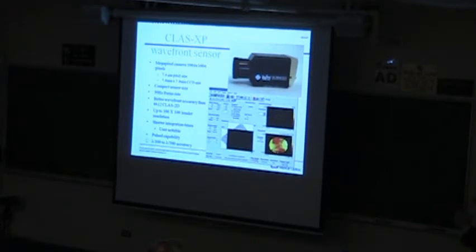And there's a nice display of that you can use. And so that turns out to be a really handy thing to use to dial in optical systems. Now you can dial it in with that tilt as well. And then you can also collimate it as well, because you can measure the overall collimation of that.